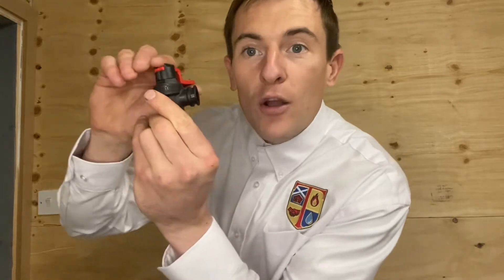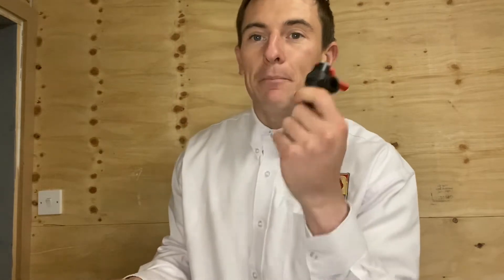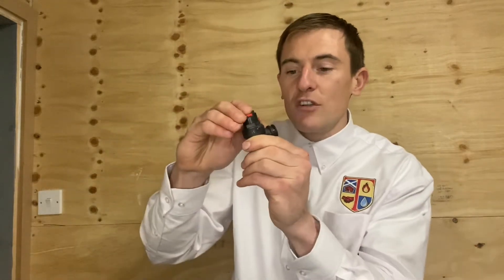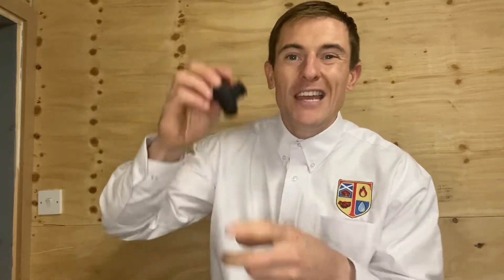Now if that is faulty or there's not the right charge in it, the water will be released through the pressure relief valve. That's a thing like this — they don't all look like this, you get brass ones and different kinds — but there's a little spring inside, and if the pressure goes up too high it releases water out a pipe to outside. You've probably seen pipes sticking out the wall with water dripping from them; it's usually this, or the old type of overflow from the header tank.